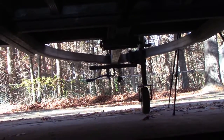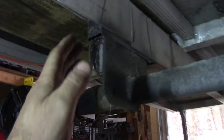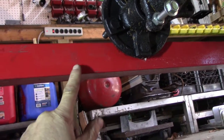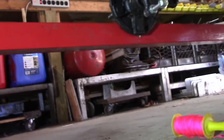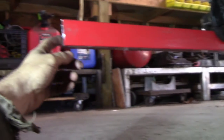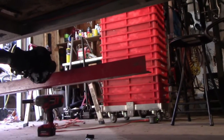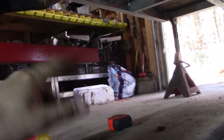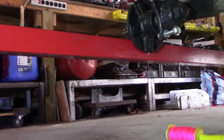We're a half inch off and I thought, okay, half inch off. Maybe we can do something with this if the holes are oblong, maybe shove one side up or tweak it. But doing this measurement here — that's flat against the flange and this is a straight piece, same as the other one. They're both straight angle pieces and I'm getting 72 and a half from the back piece to that piece. Once I saw 73 and a quarter up here, we're too far off.